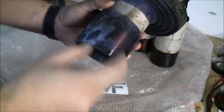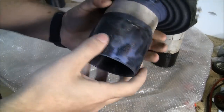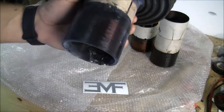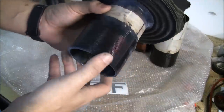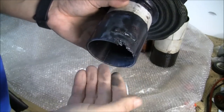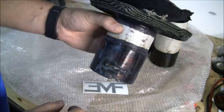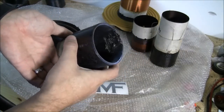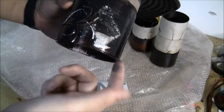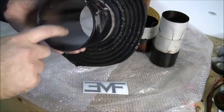We can also tell what kind of amp you had based on how it acted. The rest of the coil is still kind of the color it should be. This one may not have actually had any clipping at all based on no other signs of burning — just holes. That's just dirty power. Some people argue that, but the coil says otherwise. Dirty Chinese amps will do the same kind of thing — burn leads and similar damage. But compared to the Korean amp, which unraveled and didn't blow a giant hole, this Brazilian amp blew from one spot and came out.